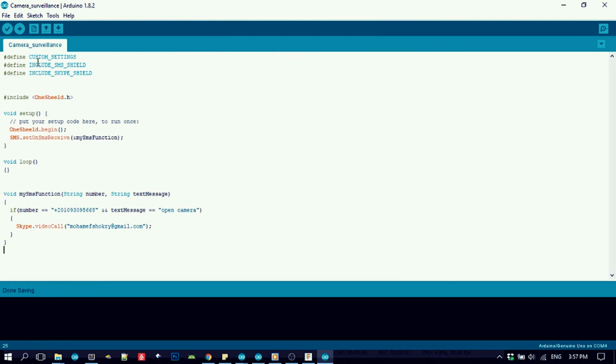So for the sketch, I've included both the SMS Shield and the Skype Shield. And of course, I've included the OneShield library. In the setup function, I've called the OneShield.begin function to initialize the library, and I've subscribed to a new function using the setOnSMSReceive and gave it my new function. In this new function, I've made a simple compare with the number returned and the text message which states "open camera". And of course, when it states "open camera", it will video call me back.